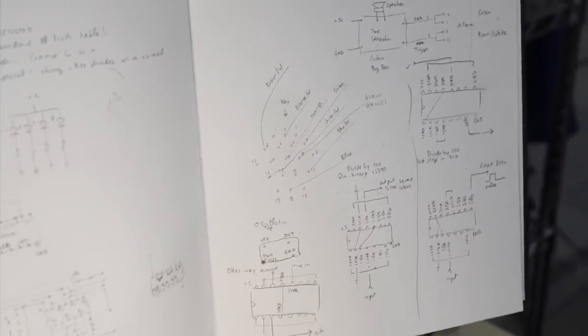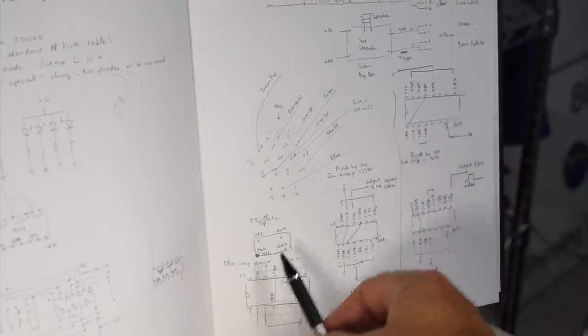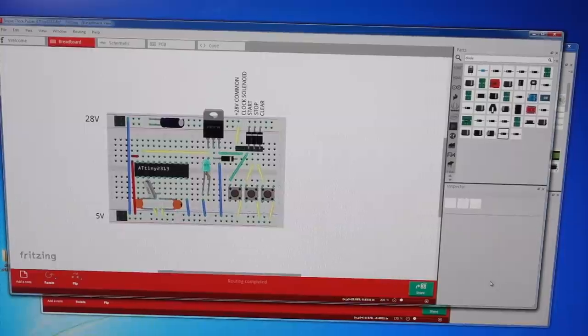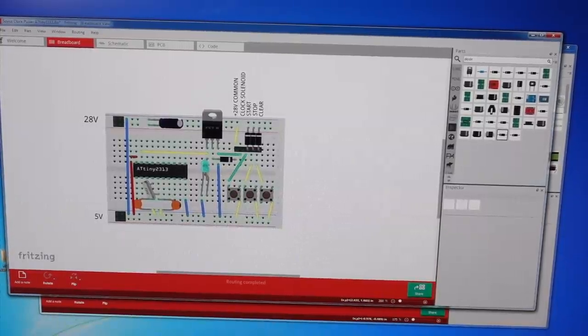And that's the amount of my research, making sure I know the pinout of the clock, and those were the diagrams for hooking up the dual divide by 10 TTL chips. They're a little bit tricky. And those are simple enough that you don't really need any design. All you need to do is give it some positive voltage, negative voltage, put a quartz in with its two caps, and that's it. And the signal comes out on the yellow wire. And that's my little MOSFET amplifier. And there are three buttons for the chronometer, and that's about it.